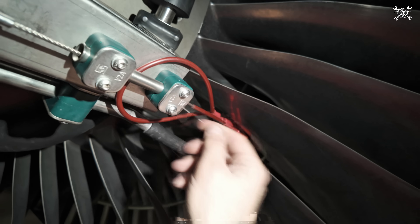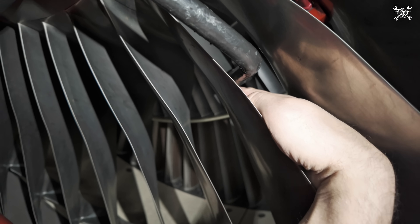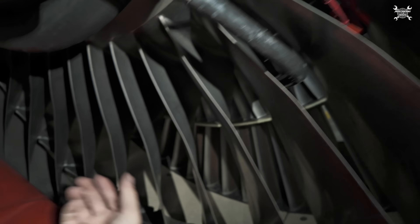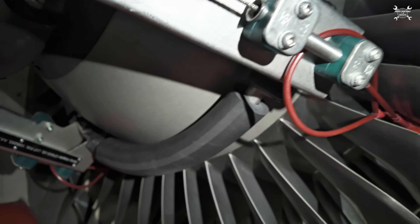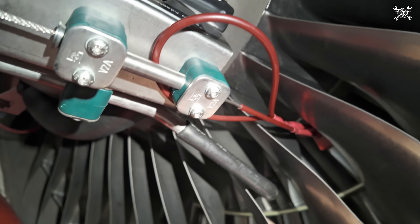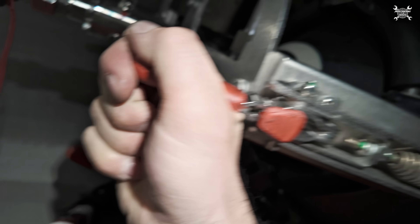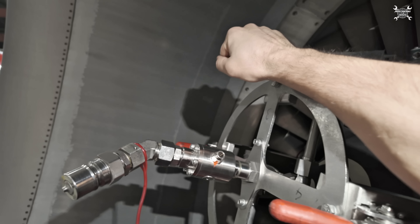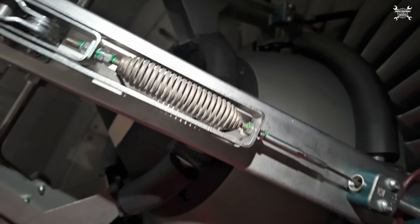Whenever you install an adapter on the spinner, you need to verify that the hooks holding it on the blades are not touching the blades, and of course the spray nozzles don't touch the blades either — you always need space around them. Check each hook and each nozzle: there is space behind, space in front, and it's pointing towards the hot section. Each of the locks needs to be secured in place — like this it should be safe to use.